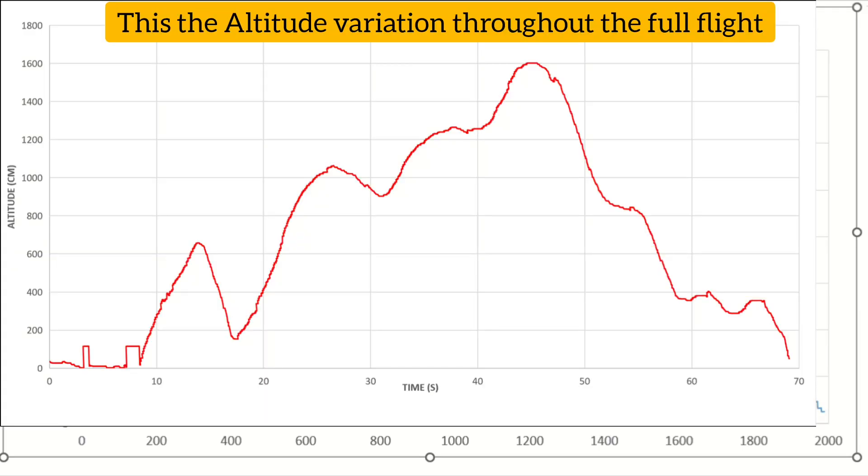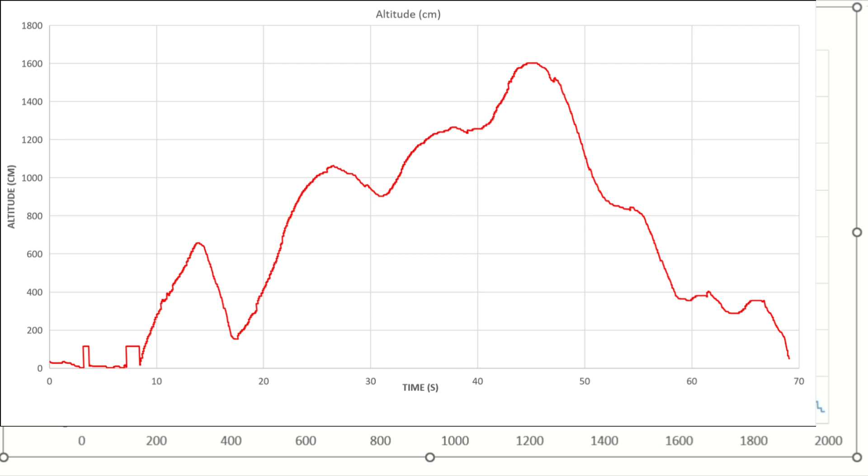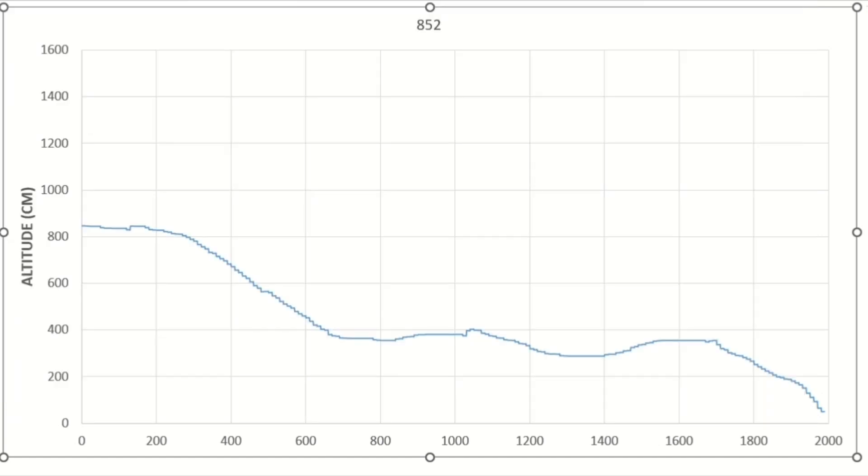Today's flight and experiment was a success. We have very good data from the barometer, which proves that I can use the barometer in my drone for functions such as altitude hold. I have already implemented altitude hold using sonar for lower altitudes, but for higher altitudes it is possible to use the BMP280. I could also go ahead with the MS5611, which is a much better barometric sensor with higher resolution. It's important to note that I have been flying this drone in manual mode — the entire operation is manual.